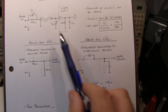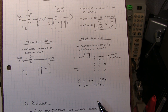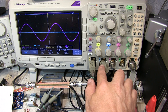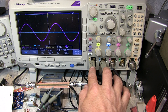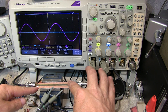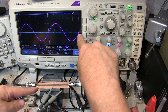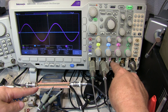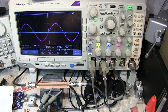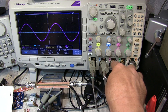So if they're not adjusted right when setting up the probe compensation, the amplitude readings will be off. I've got a pair of Tektronix P6133 probes connected up to the scope here, and I've got the output of a signal generator coming through an exposed transmission line, which is then coupled directly into channel 3, so we can monitor the waveform directly from the signal generator. We'll use the probes to probe what's going on on the transmission line.